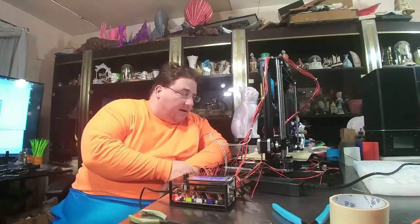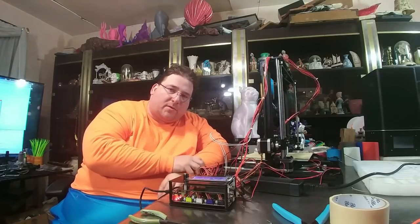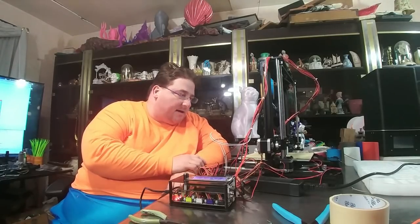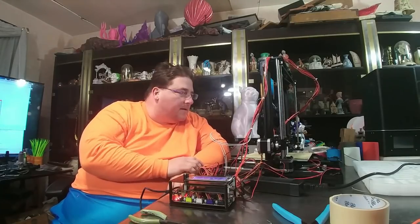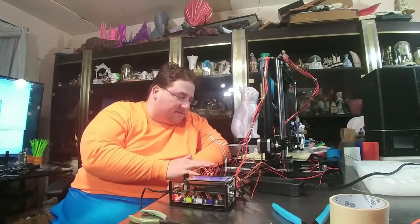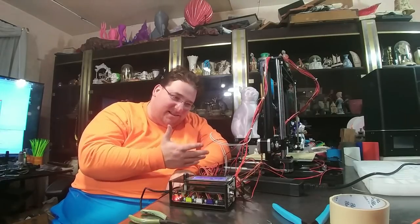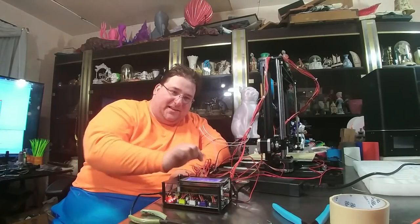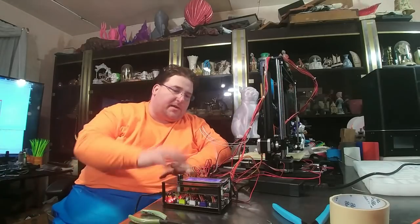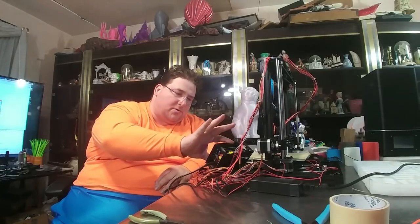I actually finished it in one day. I got it going and it's working. I had a problem with some of the end stops, but it turns out I had two of the motors going backwards — I just pulled the wires and reversed them. I think I had the X and Y motors plugged in backwards so I need to double check that, but for now it works. The hybrid construction is pretty cool and oddly enough it looks good. I've got the wiring wrapped up neatly — I put some kind of wrap around it for the primary pigtails — and I'm thinking of G-Max style mounting the controller right on the frame with a 3D printed mount. Heats up quick, no problems otherwise, but there's no spool holder.